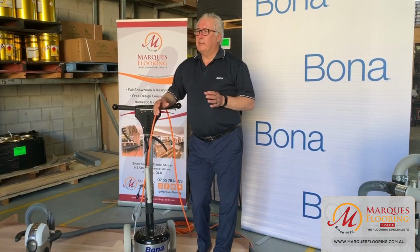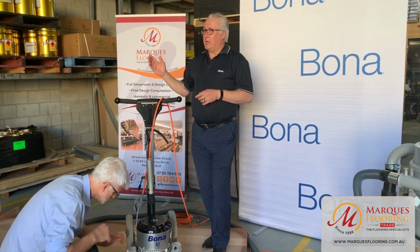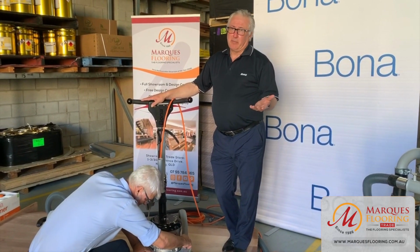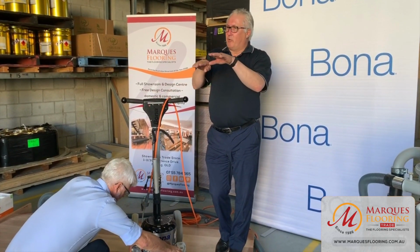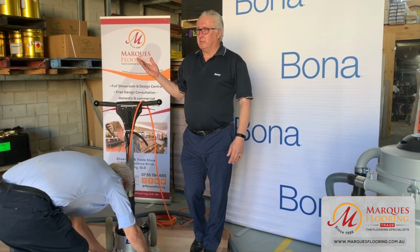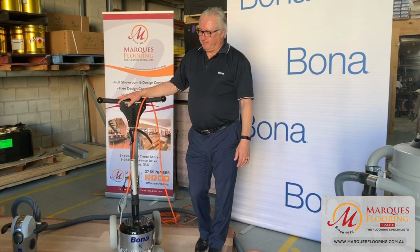It can also be used as a concrete grinder. Now, I want to clarify what that means. It does not mean that you as a flooring contractor will open up tomorrow as a concrete grinding company. It's for people who are installing floors who maybe you're doing direct stick on a regular basis and the slab's not right. This will level the slab. If there's a transition point between the old slab and the new slab on a house, it'll level that area. That's what that's designed for. It's not designed to expose aggregate, but it does save you time of going off to hire something to bring it back. You have the tool and you can use it accordingly.